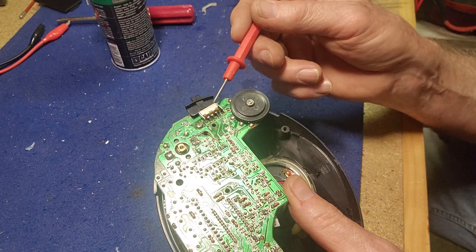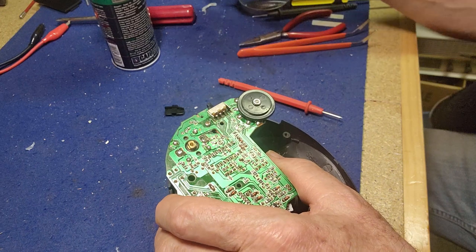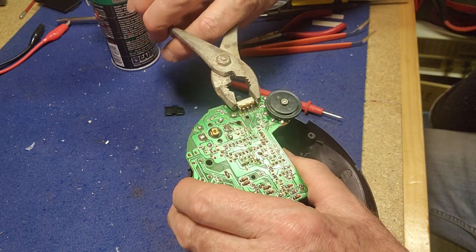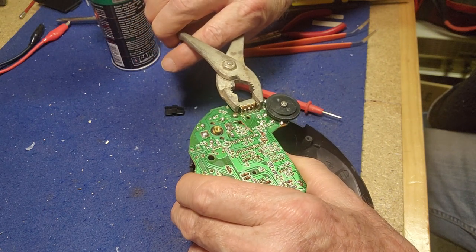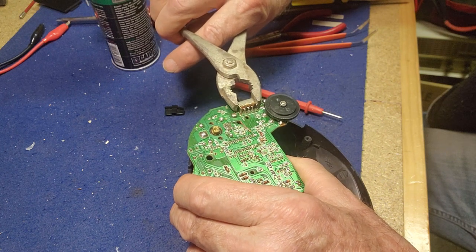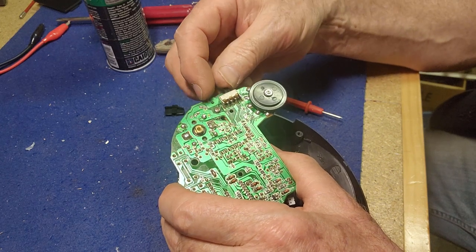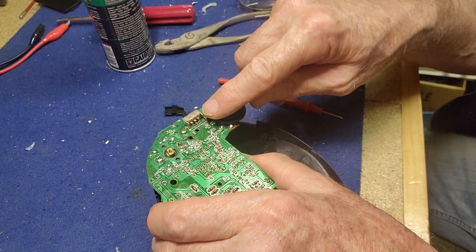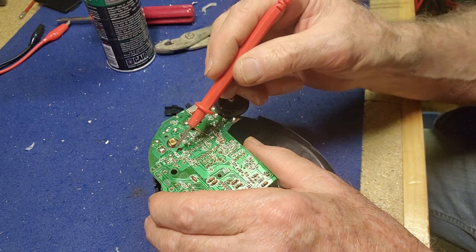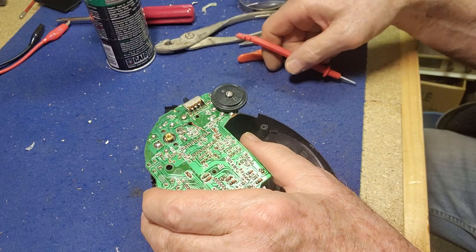I might try and just gently get some pliers on there and see if I can straighten it. This button should come off - yep. It may have an internal problem that we can't fix, but I think if I straighten it a bit, at least it'll look better. It's possible that it might have been assembled that way and needed to be kinked to fit through the casing - you never know. That's squared up a little bit. It seems to operate fine, but it's quite possible that it wasn't making a connection inside. I did re-solder a couple of connections around the tuning capacitor that I thought looked a little dodgy, so let's power it up again and just see if we've made any improvement.